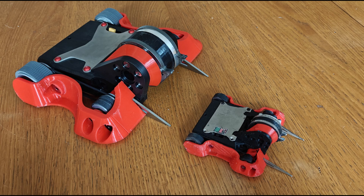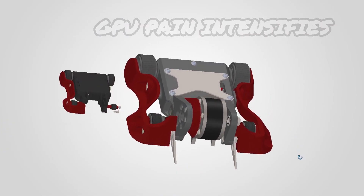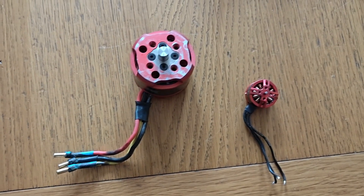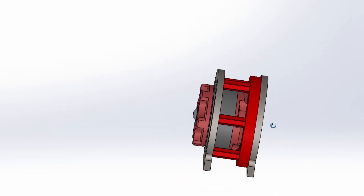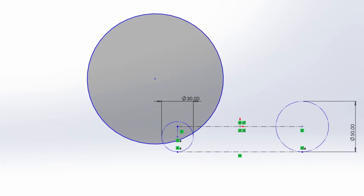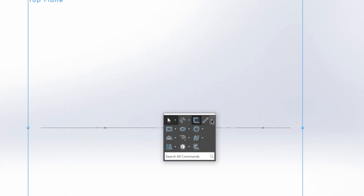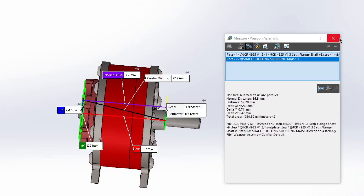So now we arrive at the present day design, V4. The plan was simple: take the ant weight CAD and scale it based on the diameter of the weapon motor at ant weight size and the Just Cause Robotics 4935 weapon motor I'd be using for the beetle. In theory this should make the robot handle about the same, and hopefully all the design flaws ironed out with the ant would pay dividends in the beetle. There is a small issue though — historically for the ant weights I'd 3D printed the chassis, but I don't really want to do that for the beetle because I really like the HDPE construction. It's a nice material and a lot less shattery than 3D printed plastics like polycarbonate, nylon, or PLA.